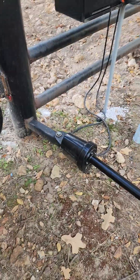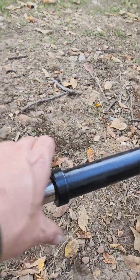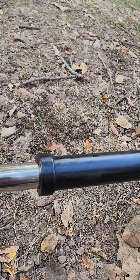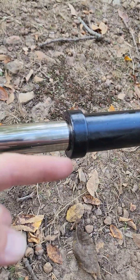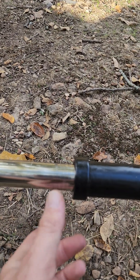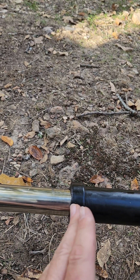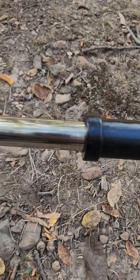First off, you need to know that your ram rods are moving freely. You don't want your rods unable to move within the cylinder. If you take these four screws out down here, you can slide your sleeve back and forth and make sure it's free moving. This one was not — the seal was bound up. Somebody had tried to service it, took the rod all the way out, and forced it back in the wrong way, which cockeyed the seal. You can only put the rod in from that end forward, pushing it this way, because the seal sits against the inside edge. If you try to force the rod in the other way, it'll bind the seal.